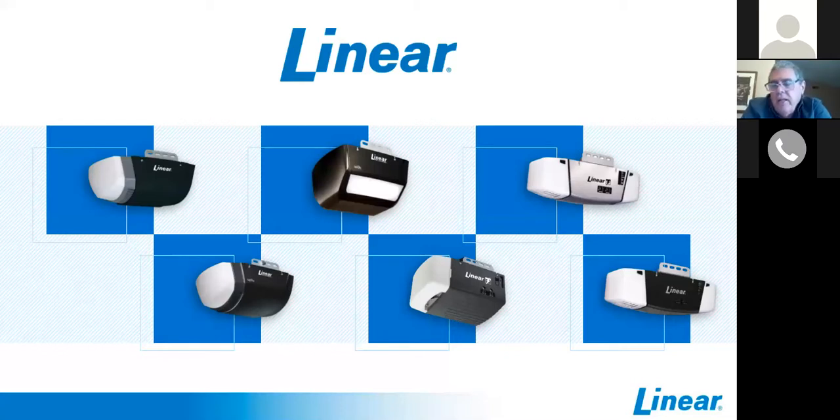And then the one underneath on the right side is our LCO 75, a 3/4 horse motor, designed for your taller doors, your heavy doors, wood carriage house, all the way up to a 14 high light commercial. Those are our 5 or 6 different operators. We only use 3 logic boards to achieve this, which is nice, interchangeable, literally back to day one. If they installed an AC opener 10 years ago, today's logic board will work. If they installed a DC, the logic board of 12 years ago will still work fine.